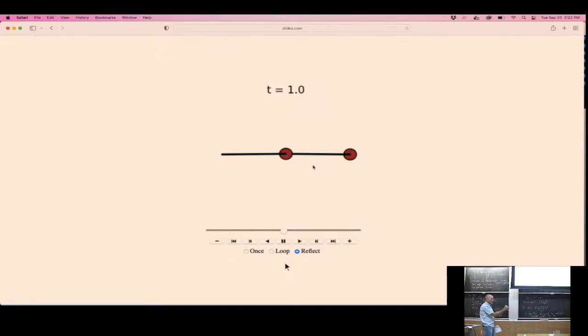Great, so I can't flip in that case, but let's say I was just going like this and back, right? So this is your example, but not going to full extension. At any one of those configurations, if I wanted to command a particular XY velocity of the end effector, I could do so with a reasonable velocity in the joint angles, right? So that's the big difference. In all of those configurations here, I still have the ability to command a velocity in the end effector. It's only when my Jacobian becomes close to singular, and when it's close to singular, it just requires ridiculously large velocities. And then when it's singular, there is no velocity.